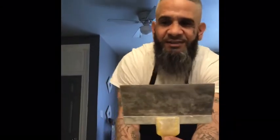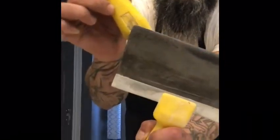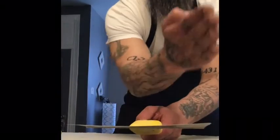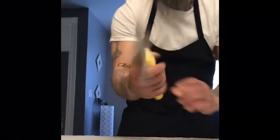So what I did is I took my knives and I shaved them on the sides. This one is not shaved that much, but the third one I have is the same size and it has the curve — it has a round edge on both sides. That way, when I am putting spackle, I don't get that line that you always get inside the compound. Now, I bend it this way — if you notice, it has a bend on each side. I'm going to show you right now why I do that.